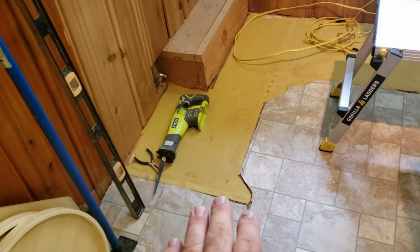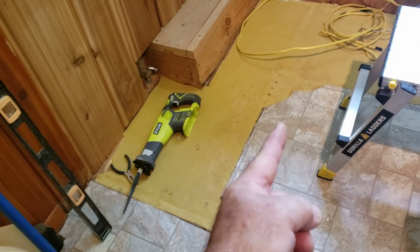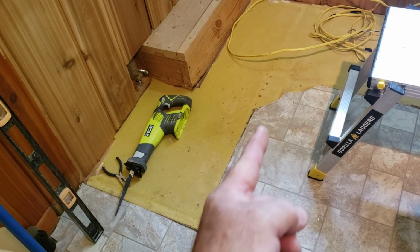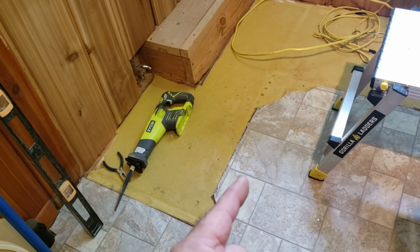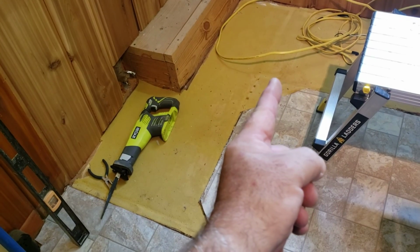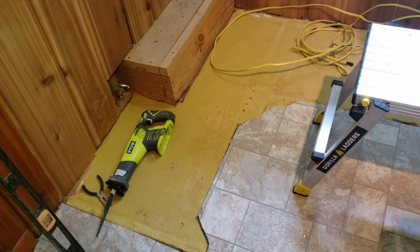Over here, the same thing on the right of the stove. We're going to add a 642 filler in the front of this, drop that toe kick all the way down to the corner over there, straight, add an OG pilaster to the front of that, and then that pilaster is going to run under the toe kick in the corner and turn back and follow that 45 degrees right there.